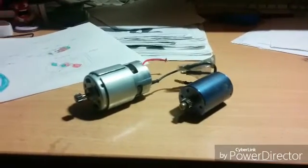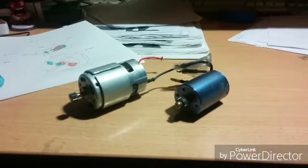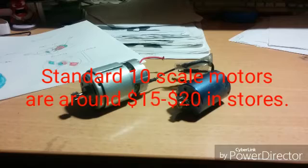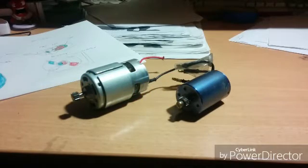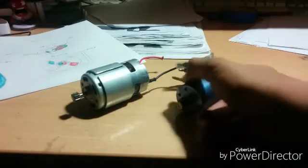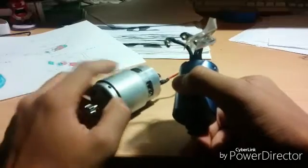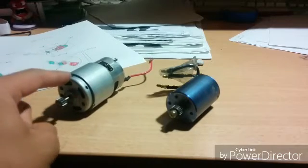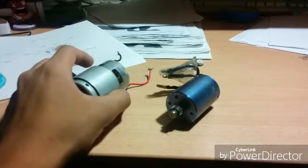So what are the advantages and disadvantages of brush and brushless motors? It's pretty much a personal choice. The advantage of brush motors is that if something goes wrong and you need a new one, you don't have to change any electronics on your car — you can just buy a new motor and keep your regular ESC. But with brushless motors, you have to change the ESC as well, whether it's a car, truck, boat, or helicopter. That's also why brushless motors tend to have three wires instead of two.